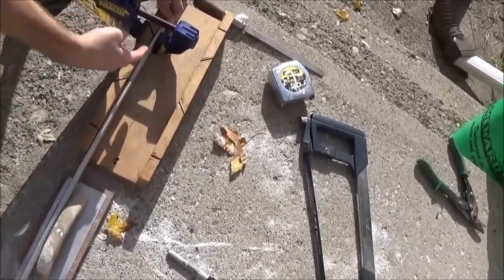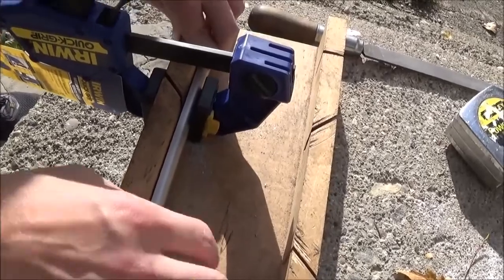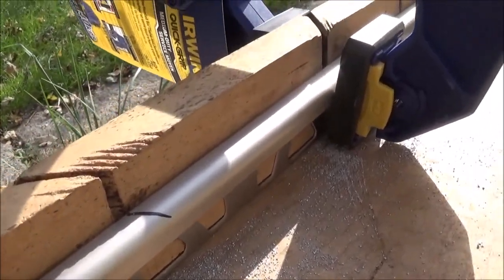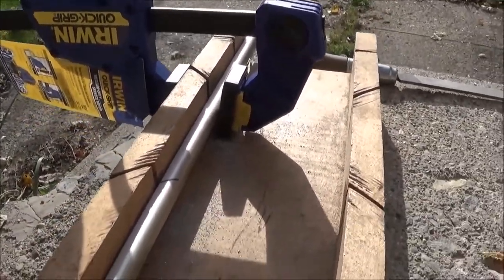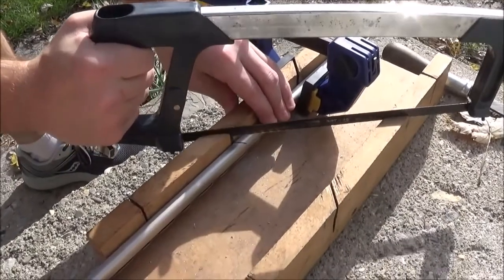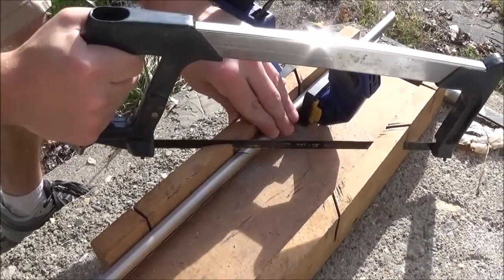Crank it down. Be careful — make sure the clamp is clean because this scratches pretty easily. I was a little disappointed in how easily this scratches; it is just aluminum. Get it sitting on its side in the miter box and hold any loose ends so it doesn't move, because movement causes it to look horrible. When you start the cut, you have to own it — push hard and not skip. Start at a slight angle, rest the saw on the other side of the miter box, then chomp down and do it.